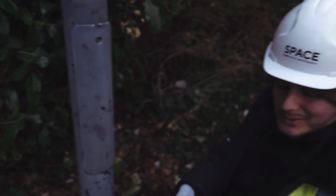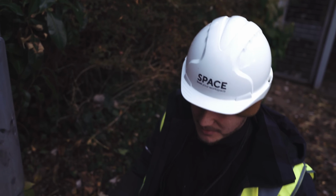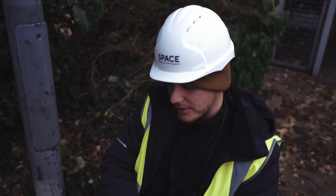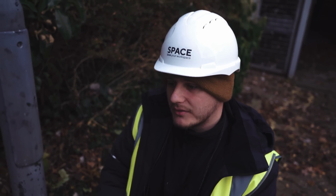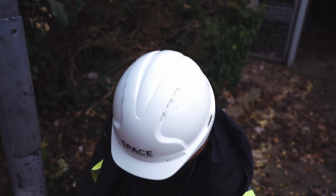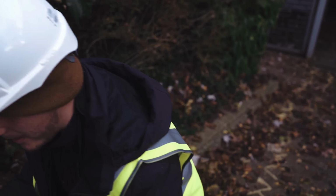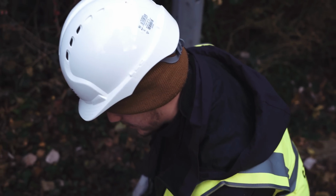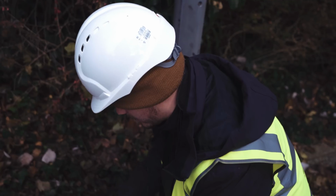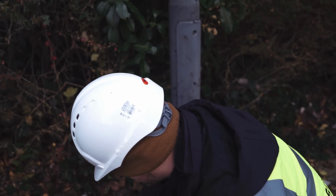You want to check that as well, because I don't know who filled out that certificate. They could be completely wrong on the maximum ZS for that breaker. Who knows? They are also 3871s, so they're an older breaker to an older BS number. Obviously, your traditional breaker, 60898 or RCBO, will be maybe more tolerable as well. Might be a better device in that respect. So yeah, we've got to look into that too. But at the minute, existing install wise, that fails, which is interesting.